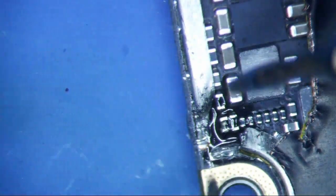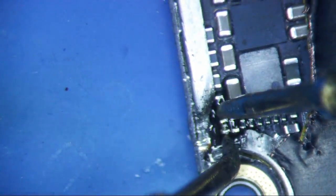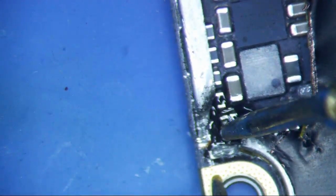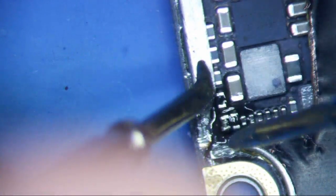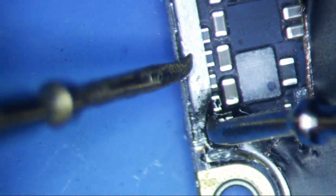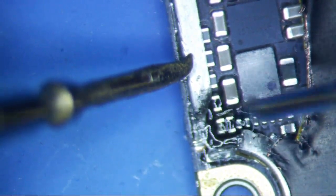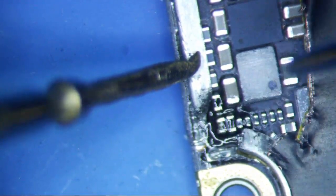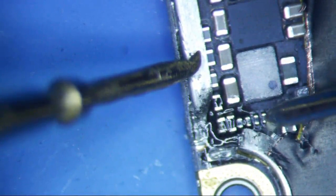Let's double-check it with our multimeter and make sure there's continuity across it. Now there's continuity, and we can also check diode mode just to make sure that's not ground. Going the right way: 0.51, 0.51. Those look like cathode lines, and this must be the other backlight line.